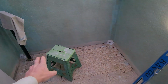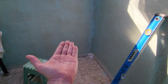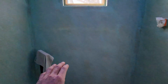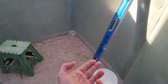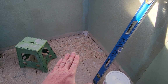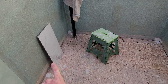If it didn't make this video, I do have the bottom with no waterproof membrane yet, because again, we're going to start above on all sides of the walls, so we're not fighting that weight. And then after I've tiled these walls here, I'm going to do my flooring, and then I'm going to put the Schluter Kerdi-Band up against all corners of the bathroom. It's going to go on top of my Schluter Ditra flooring membrane, and of course, stay tuned for that. But that's why you see bare cement backer board right here, in preparation for the Kerdi-Band on top of my Schluter Ditra.